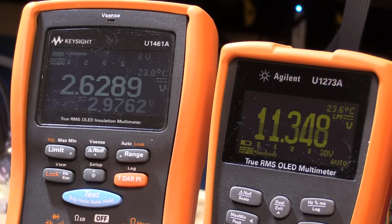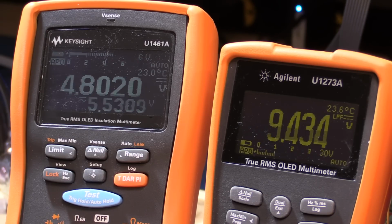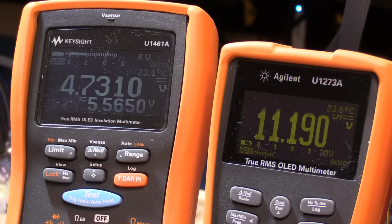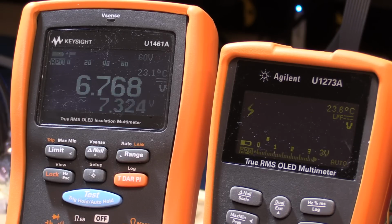Now if I change the current limit by decreasing it, you can see the voltage is changing there a little bit. The output is still the same, but now I'm going to be able to drag the output down, right? That's back to where we were before. The voltage limit is still set to the max. So as I drag this down, the current limit is taking control. Now it's hard to tell what it's doing here because I'm switching the loads over such a range that it's actually coming in and out of control, which is a little bit difficult to see what's happening.